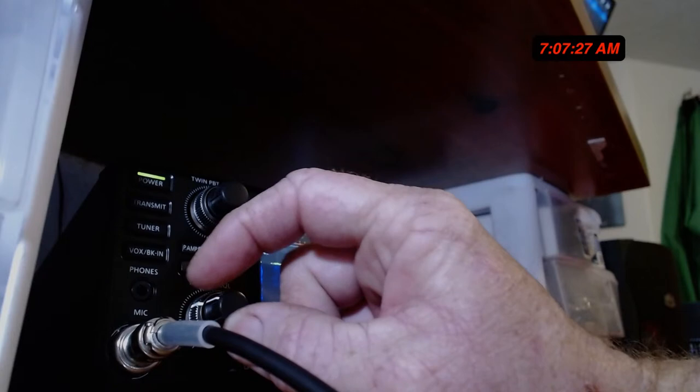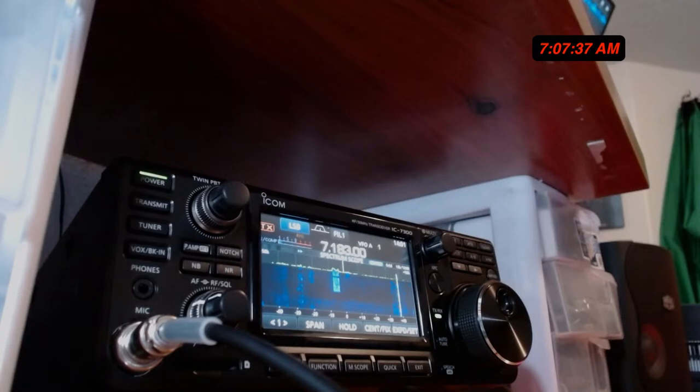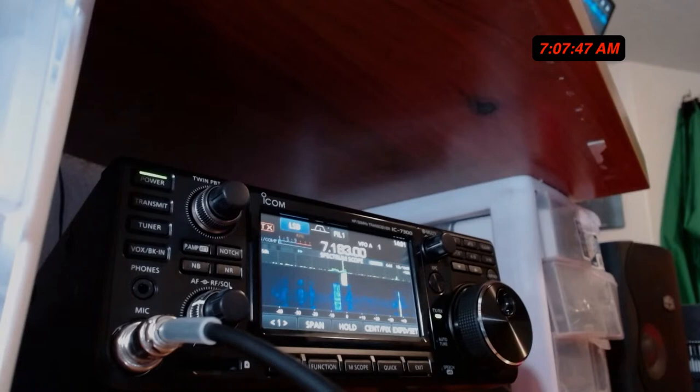Now, the current MUF, or maximum usable frequency, is right about 12 megahertz at Boulder, Colorado. 12 is quite a ways from 40, but it's not so far from 20. We may switch. We'll see what conditions do, okay? Again, station, please. This is Kilo 7 Hotel November. And we might have people walking over us.